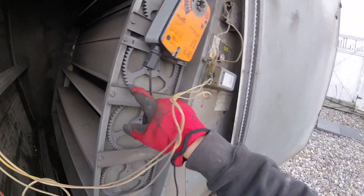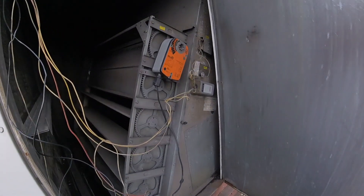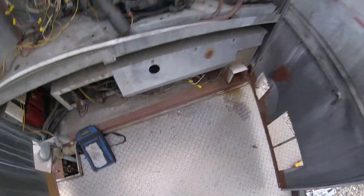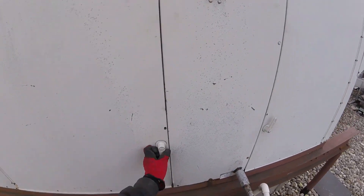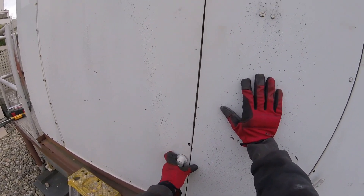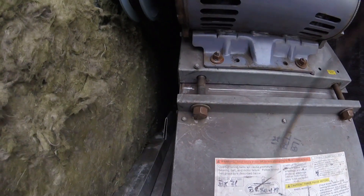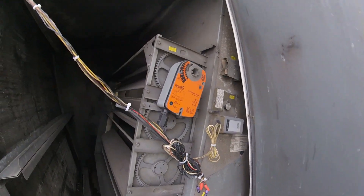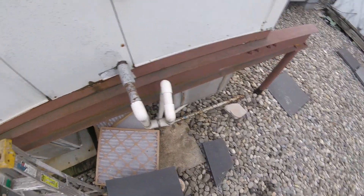So when that's energized it's going to work these gears. Everything is wired and we're ready to test. We got the system running right now — we're in heat. So when the blower motor energizes, it opens up this damper. Give you a quick peek at the motor. Made an adjustment and everything should be balanced now. Everything's running fine. We got neat wires. There's the wires coming in here — everything nice and neat. And here's the gears — these two are open. So everything's cool.